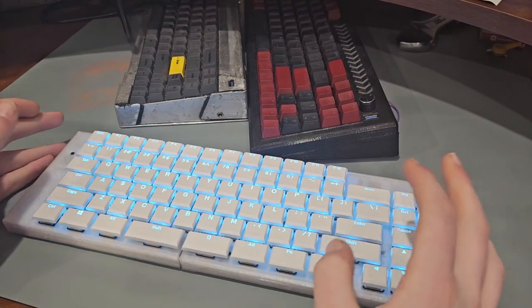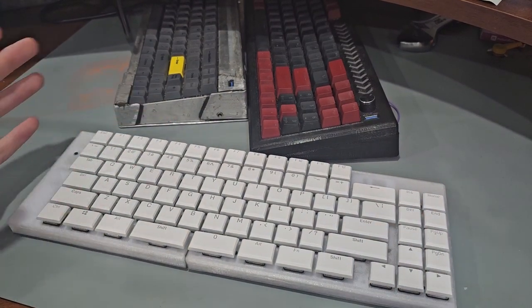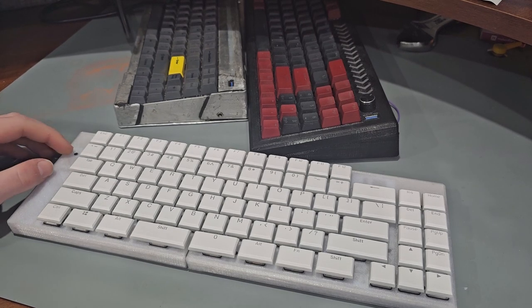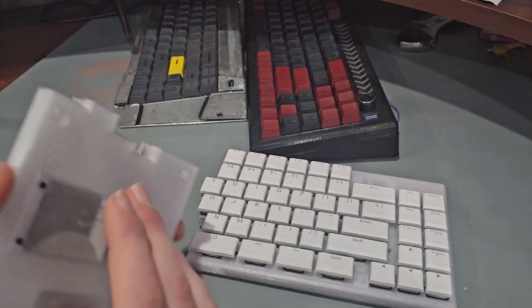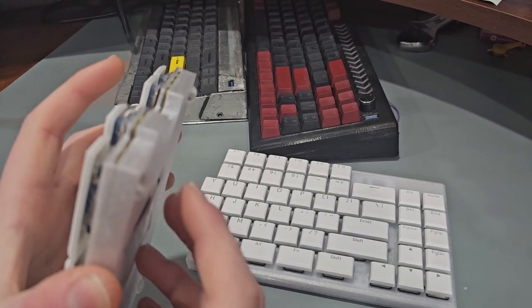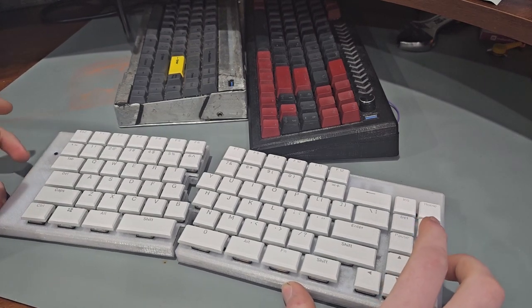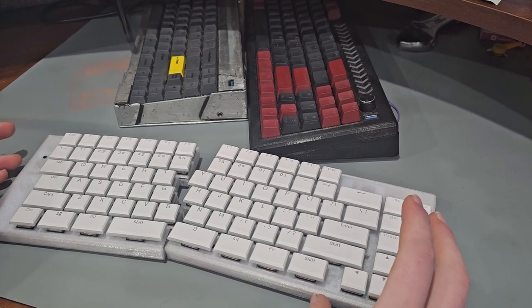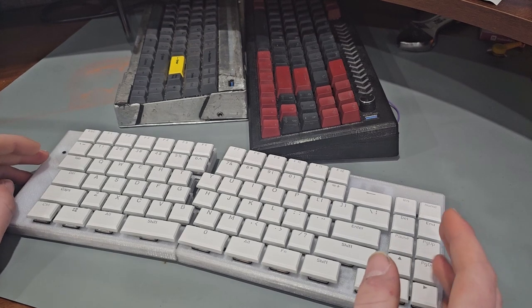Looking at where I plan to take Fendrana: the main improvements are adding the display and joystick features I haven't implemented yet — the main reason being that joystick support in ZMK isn't completely there yet. I also want to fix the battery cover since it pokes out a bit, and I've already fixed the PCB traces that needed fly wires. The goal is to get it to a state where I could sell it. I have a couple of spare PCBs and might livestream building those up over the next few days, then see if there's interest in selling them.